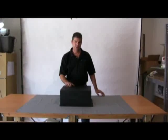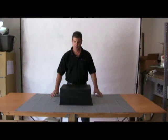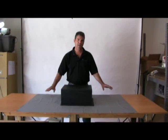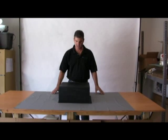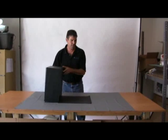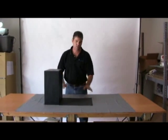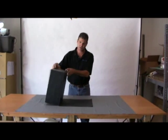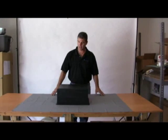I've got a model here to help demonstrate how we're going to wrap the tank system up with the liner in order to keep things watertight. First, we've excavated our hole and laid down a layer of geotech-style fabric that helps protect the liner from the soil below and on the backfill on the sides. Once the liner is installed, we lay a small piece of geotech down at the bottom of the hole to protect the liner from the installed tanks. We install our tanks down into the hole, center it up on that geotech, and then begin to wrap it.